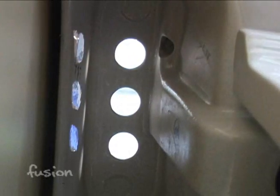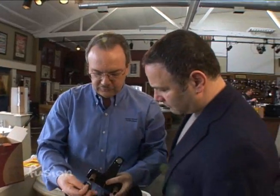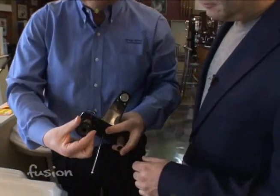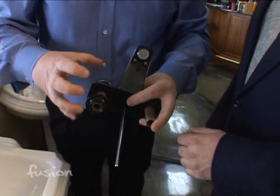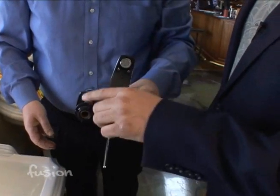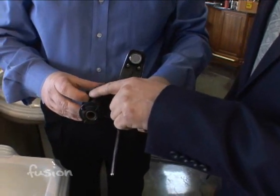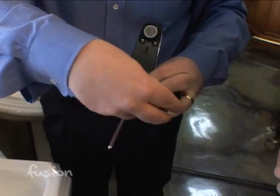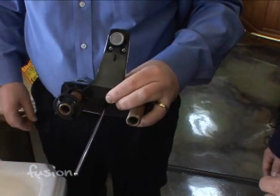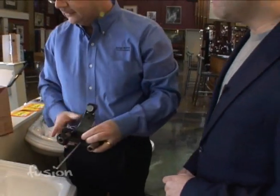So now we have, this is where we had these screwed on underneath the sink, and this is what held this onto the sink. The sink is in this area, so this would screw on and clamp it right down to the sink. And you don't need anything to hold that on, plumber's tape, putty, caulk? No, because there's no water coming at this point. The water is at the bottom. Then you'll use your Teflon tape down here.